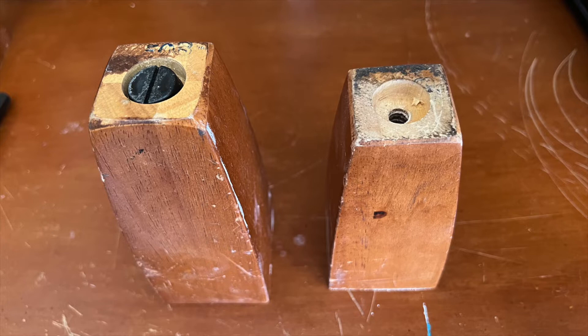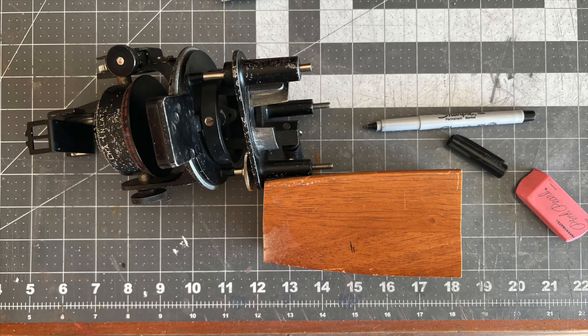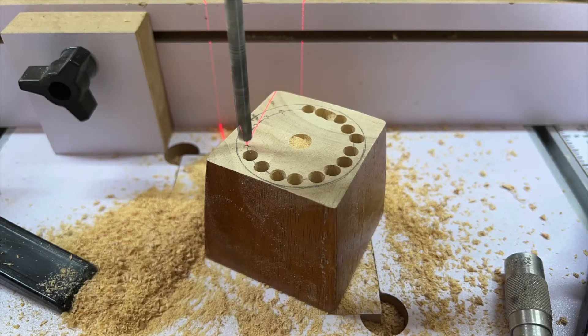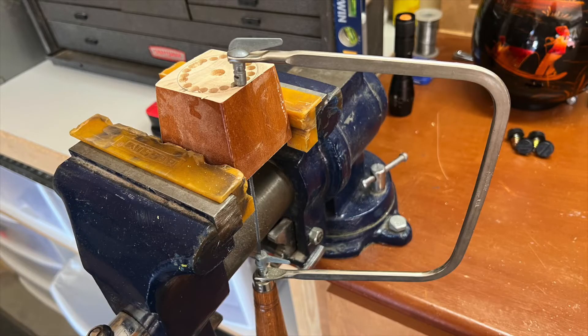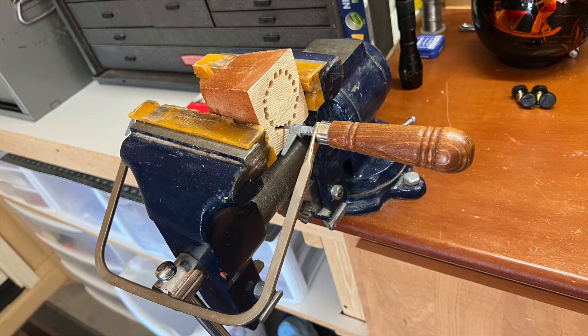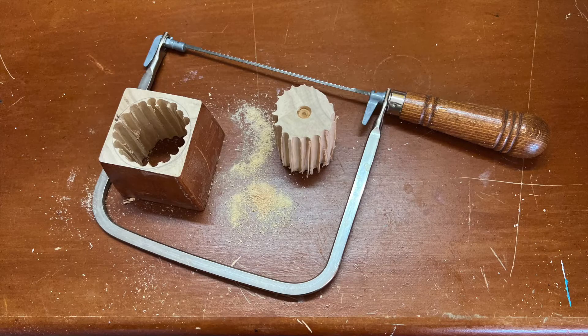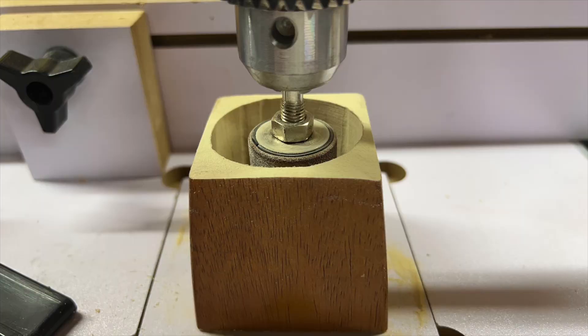So I used these table legs, took the feet off of them to make the base for this compass to hold it up on a display stand. First I had to cut out the center section to try and make a hole that would fit in the astro compass. I had to use the drill press and a coping saw in order to cut the center section out. Then I sanded it out so it was round and would slide over the mounting part of the compass.